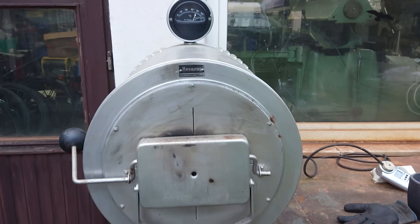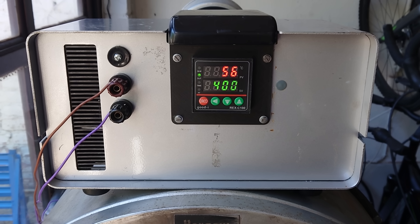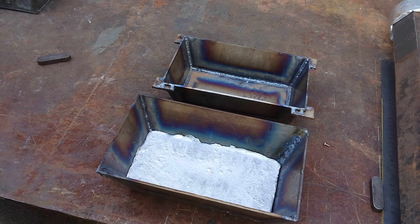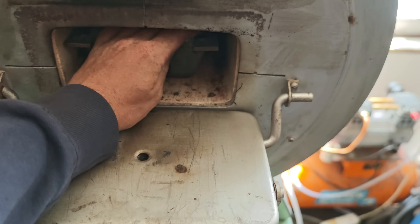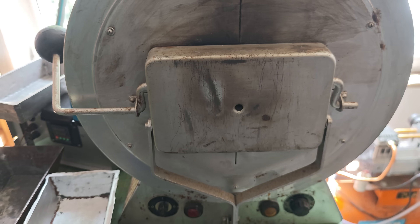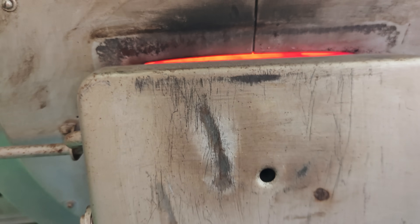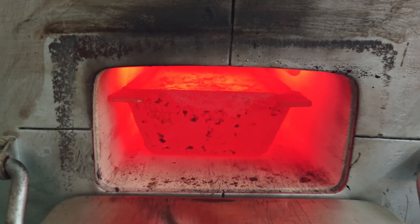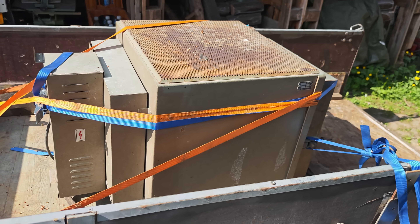In the last episode, I had modified this old furnace and equipped it with a modern temperature controller. I then also made these two molds from steel, one of which also doubles as a crucible — that pretty much maxes out the available volume inside this furnace. It heats up rather quickly, runs on single-phase AC powered by an off-grid solar array, and you can make aluminum castings of up to 3.5 kilograms in weight, which is quite a lot for what I'm doing here. So while that is really enough for the castings I'm currently working on, it has one major drawback: many pieces of scrap are way too big for this small furnace.